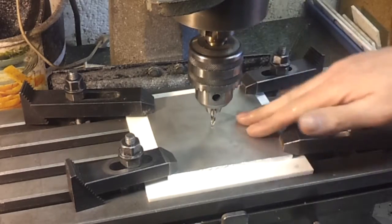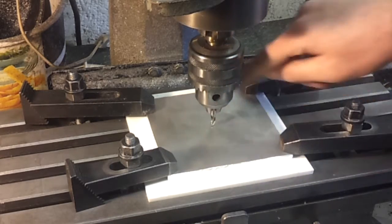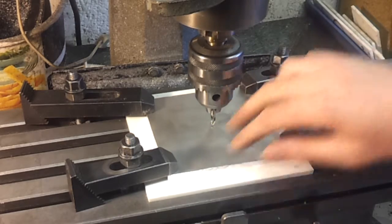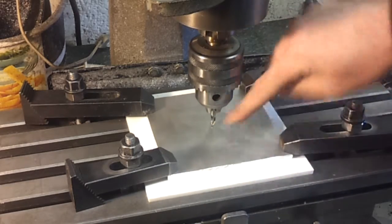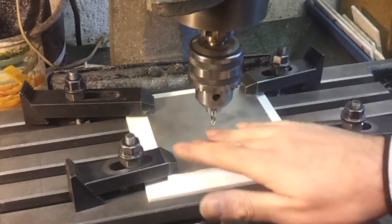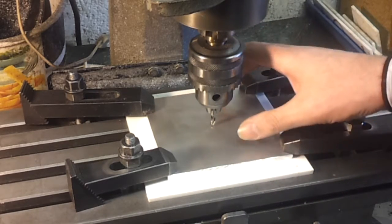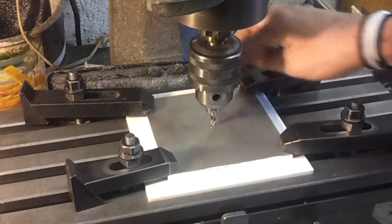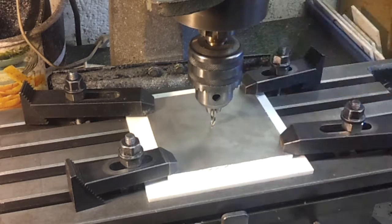First plate lined up with a 5mm slot drill. I'm going to take the 1mm deep cross-shaped runner out to begin with and maybe put a well at the centre and then the four gates around the edges. Then I need to pocket it all out — starting with the sides, swing in with the clamps, and then take the tops out. I need to do that first because I need to be able to drop that into the surround plate to make sure it fits. I can always adjust the surround plate — that's an easier job rather than doing surround first and core second.